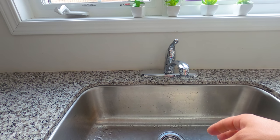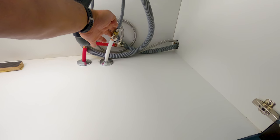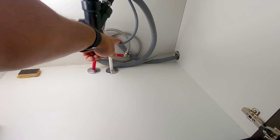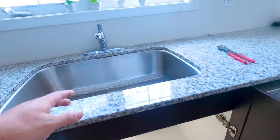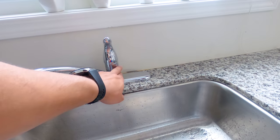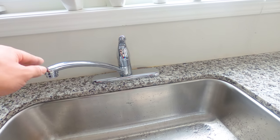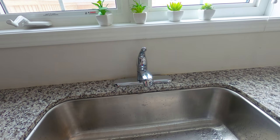But let me show you where else the problem could be. Down here we have the shutoff valves and the problem could be there. After the valves we have the supply hoses which could cause the problem. And then after the braided hoses we have the cartridge inside the faucet which has the potential to be problematic. So you need to test each of these mentioned parts one by one until you find where the problem is. I hope this video has been useful — if so please don't forget to like, share, and subscribe for more videos.